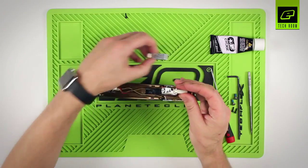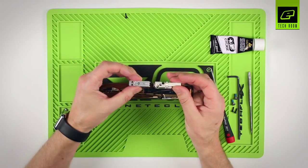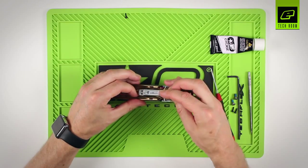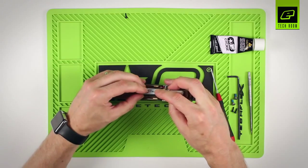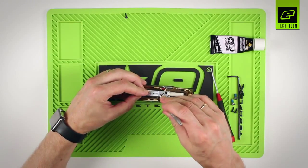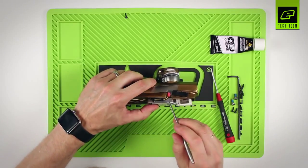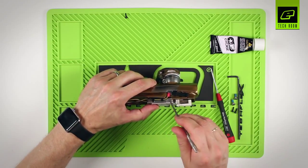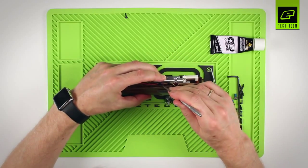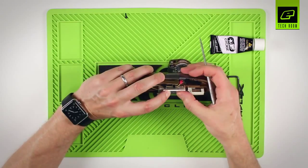Now take the pilot section, the mounting plate for the pilot, and reattach it onto the spool housing. Drop this assembly back onto the manifold, making sure that none of the wires are trapped between the manifold and the mounting plate or the spool body. Everything should be sat nicely in the grooves behind the retaining clips on both sides.